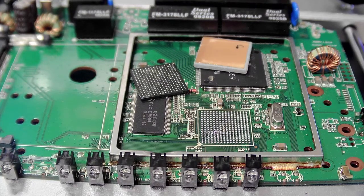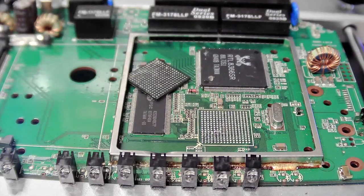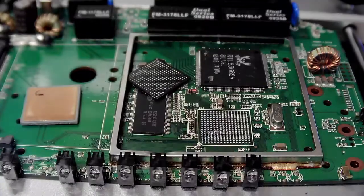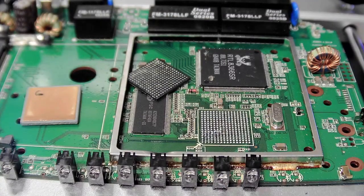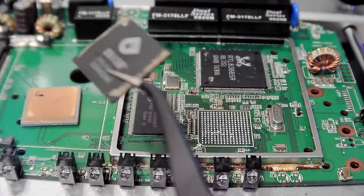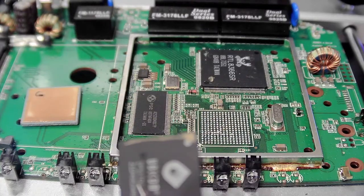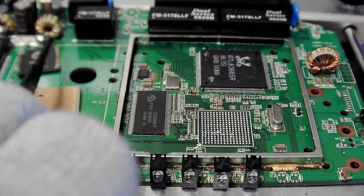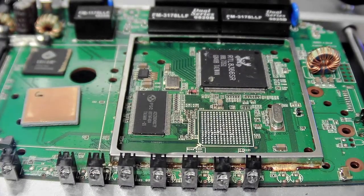All right. So what we have learned is that I didn't know what that thing was. I don't know why there was a piece of ceramic on the top. Did that work as a heat sink or something? Beats me. Anyway, they're still used for hot air, obviously. If that chip didn't have that ceramic thing glued to the top of it, it would have come off very well with the infrared. So it seems that the infrared station works pretty well in some instances, and yeah, there's no hot air and stuff, but sometimes you still need hot air.